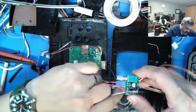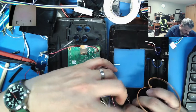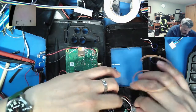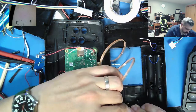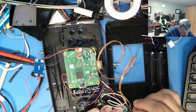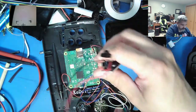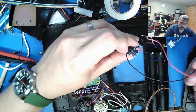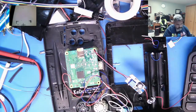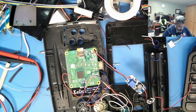Alright, let's make sure this sits in here okay. This comes in here. This sits there. Actually, I'll come back a little bit. I want to sit about here, and the reason why is there's a little plastic cap that goes on here, and I want to cover up the knob end, so that works. So this will go to the boost converter, which is sitting right next to it. Okay, this is power coming in, this is booster coming out. Boost circuit is going to sit very close. These wires are very short. Don't need to be long. Short wires. Brown is negative.